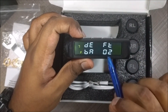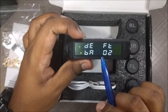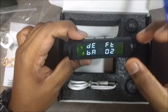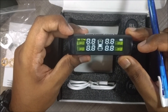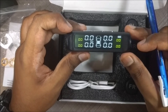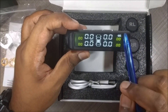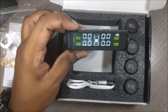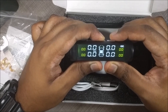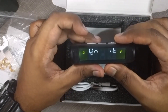First, let's go to menu option 7, which is the factory reset menu. When you come to menu option 7, if you want to factory reset the device, just hit the menu button once and wait. That's the factory reset — the temperature and pressure settings go back to defaults, such as bar for pressure, and the entire unit has been reset. Now that we've reset the device, we can go back to the menu. I'll change the pressure unit back to PSI since I prefer PSI.